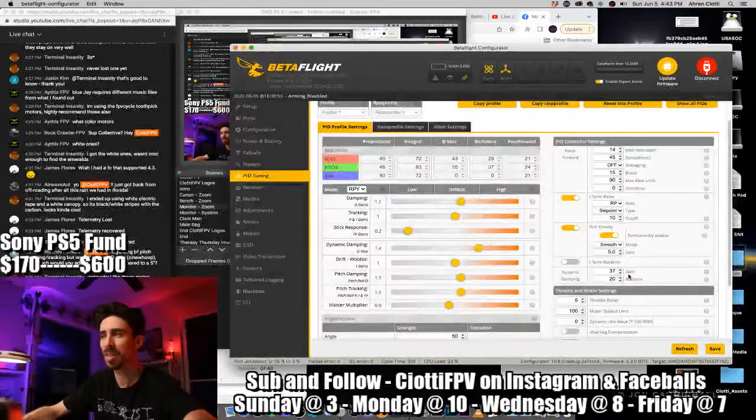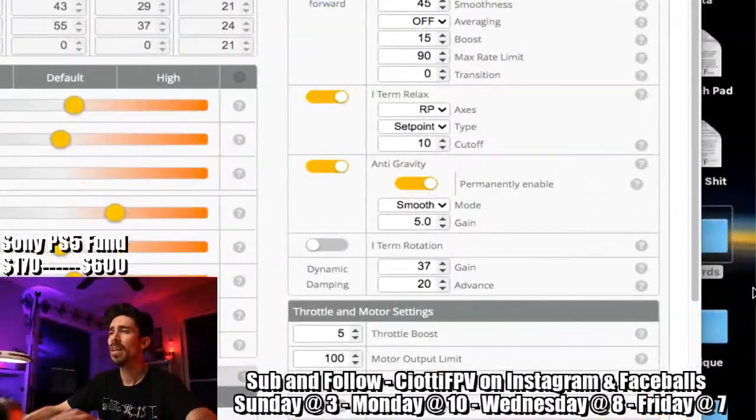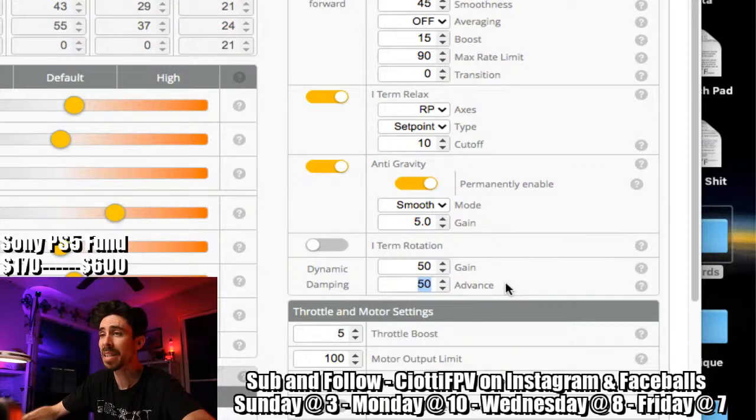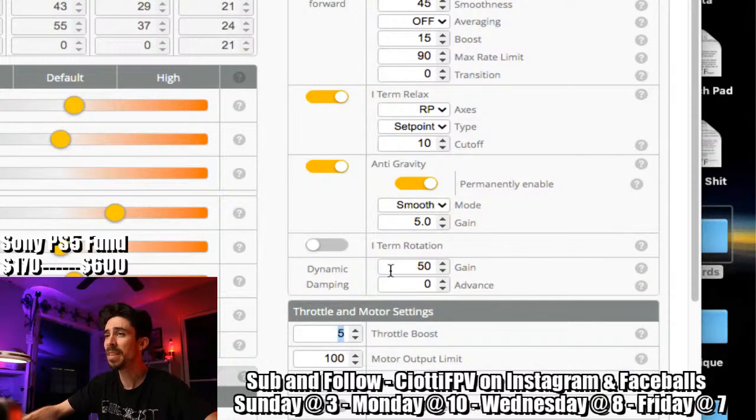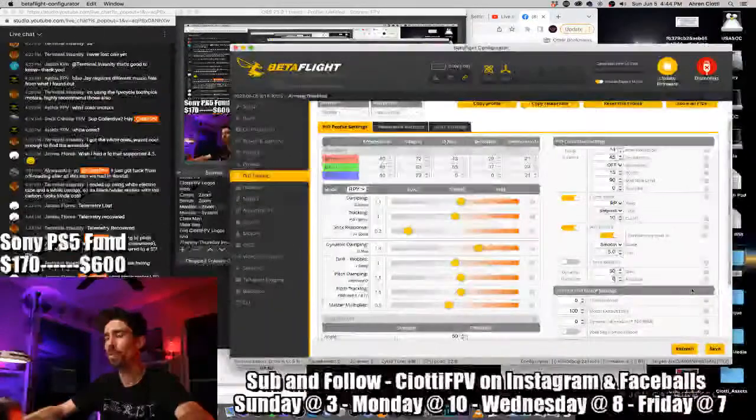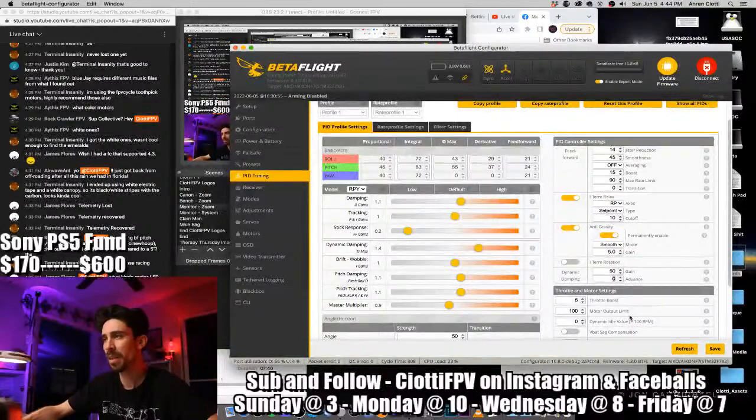Dynamic damping is a little bit of a question mark right now. I've had a really rough time with 4.3 with my old dynamic damping settings. I used to set it to 50 and 50, and that worked amazing in 4.2. This advance of 50, I have not gotten that to work in 4.3. I've had to move the advance all the way down to 0 on most of my builds. And if you roll over the tooltip here, it even specifically says, generally, it is best left at 0. So, yeah, the 50 gain still seems to work really well, but this advance, I've been zeroing it out. I'm going to revisit that and try to start bumping it up, but not quite yet.